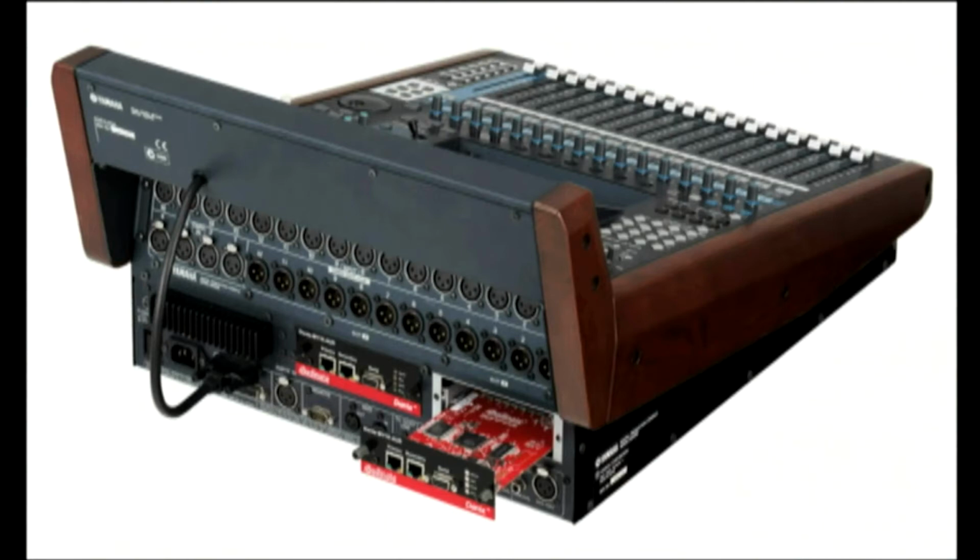So the Yamaha 01V architecture only has 1 slot, and each card will give you 16 channels in, 16 channels out. If you have a bigger Yamaha console, this is a DM1000, I believe, so they have multiple slots. Then you can run more channels. You can have 2 cards in there running to the same PIX 260, so then you have the 32-track capability.